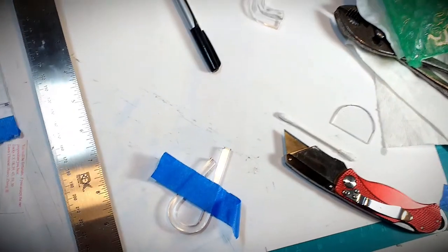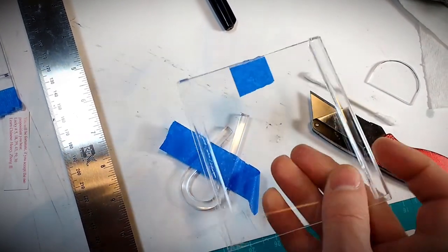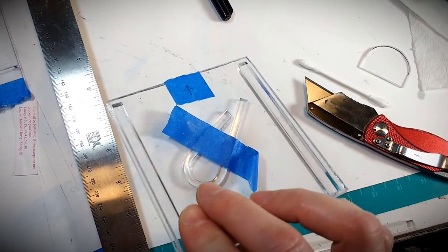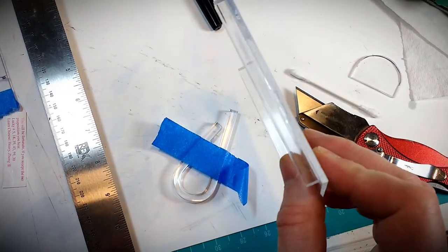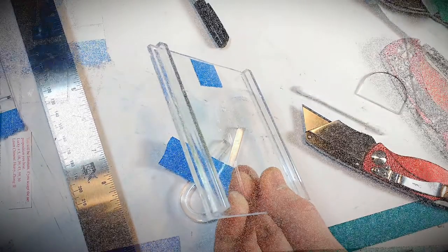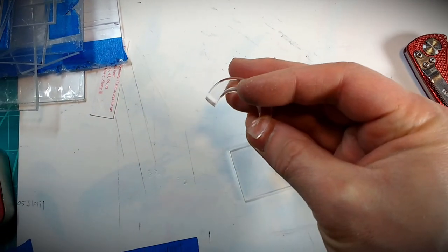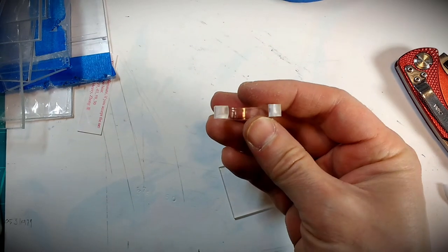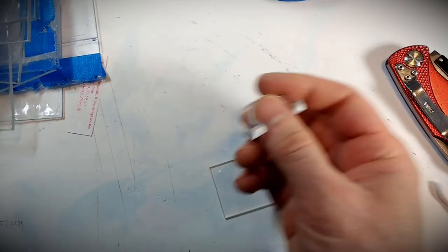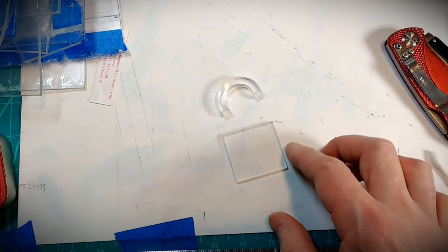The straight pieces, just as they are, I was using glued onto either side of the lid piece. And that way that'll create a force fit for that onto the box. After making the trim on the waist piece section, I sanded those edges down and I used the solvent on the cut ends again to finish off that sanded surface.